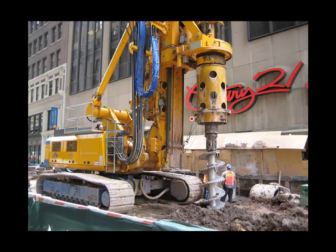You begin by starting with a very heavy, low center of gravity drill rig, and that kind of rig is illustrated here. Because of the massive weight of this rig, the upper connection can be considered as a fixed point. The drill will be held in place and will not move.